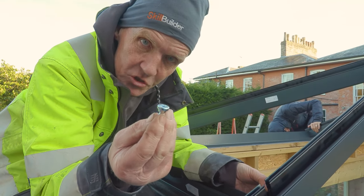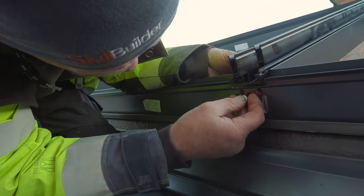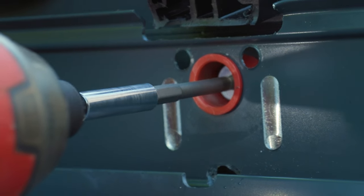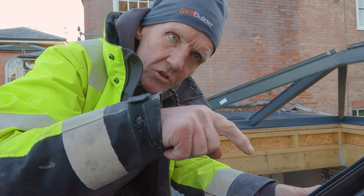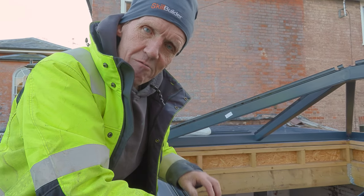The best thing to do when putting these bolts into the rafters and hips is to look up through the hole and check that it's aligned, so you're not trying to drive it in on the crosshead because these can move slightly. You can see how driving that bolt into the rafter end pulls the whole frame straight. That's why you don't screw the frame down into the curb first. Get all your rafters and spiders on, and once it's all bolted up firm and solid, you can screw it all the way around — the holes are already there so you'll know exactly how many screws to put in.